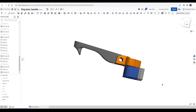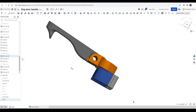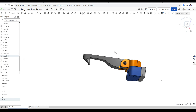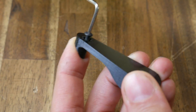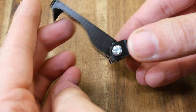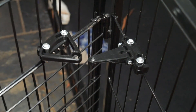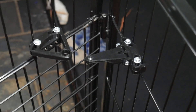With this printed and in place, everything seemed to perfectly align from one side to the other, so the last job was to design the latch. Here is the final shape — overall quite simple with a couple of detailed additions. On the underside is a boss that protrudes to stop it dropping below horizontal, and because the protrusion which actually does the latching wouldn't be particularly strong with the way it's oriented, I decided to put a hole in the top where a short M3 bolt could be screwed in to reinforce the geometry. This part was designed to be printed without support material, with its upper surface touching the build platform. With the latch printed, the first assembly step was to screw in the M3 bolt, then attach it to the pivot base. With all parts only loosely mounted, I was pleased to report that the system definitely worked — the two parts locate and the latch is secure enough to hold the gate in position.